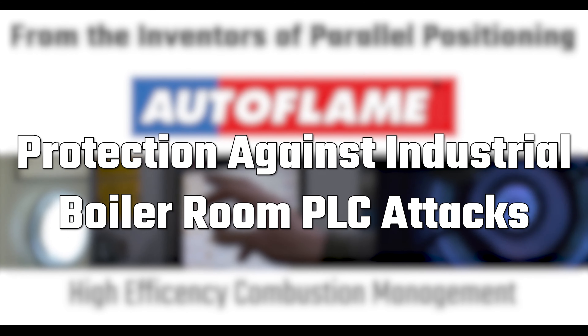We also have a diagnostic button. Pressing diagnostic I can see exactly my processor temperature, my mains frequency, my voltage coming into the system — and it will tell me when it has hit too high or too low voltage. So maybe in our boiler room we've got a big compressor running, and every time that kicks in we may see an increase in our voltage. This will log it.